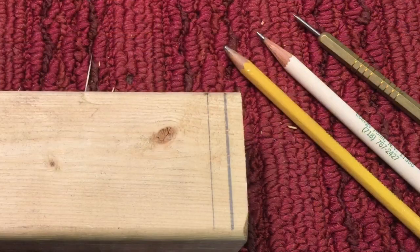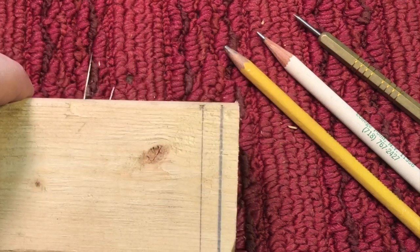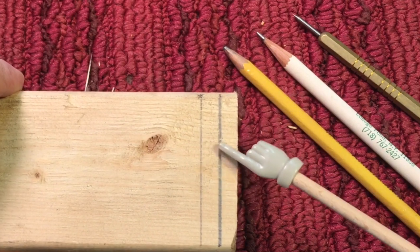You'll really enjoy it. Now, one of our subscribers, John Michael, was asking how could he increase his accuracy when he's cutting. Like if he had to cut a length of board, how can he make it more accurate? Because he was having a little difficulty with them matching up and things like that. And I'll show you what I think some of the top problems are when trying to get more accurate when cutting a board. Now, the first problem a lot of people have is making their initial cut line. Now, you can see here I have two lines, one made with a dull pencil, and this one's made with a sharp pencil, and you could see the difference.